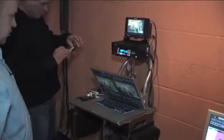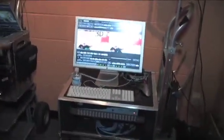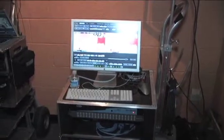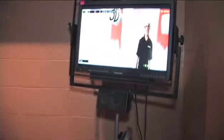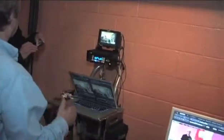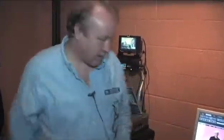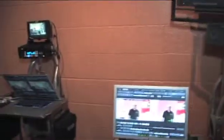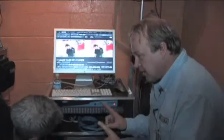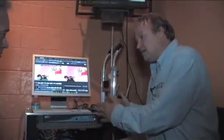In the case of the 2X system, you're outputting two channels — one output of the graphics processor, a big wide 3840 by 1080. So it's two 1920s side by side. This is outputting with one graphics processor, one great big super-wide HD signal, and then the triple head to go splits that into two DVI signals, giving you 1920 by 1080 DVI number one and 1920 by 1080 DVI number two.